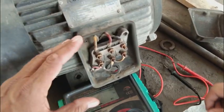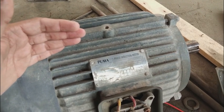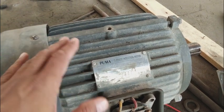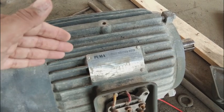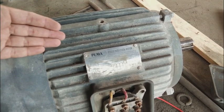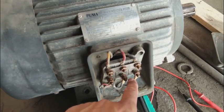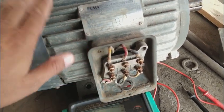If you find that the motor has zero resistance with its body, for sure this motor is bad — there is no other question. Inside the motor there are slots where the windings are placed in insulating material — insulating papers. Due to any reason, if very high voltage is applied to the motor, or the motor has been overheated, the insulation breaks down or burns out inside the slots and the winding becomes shorted to the body.